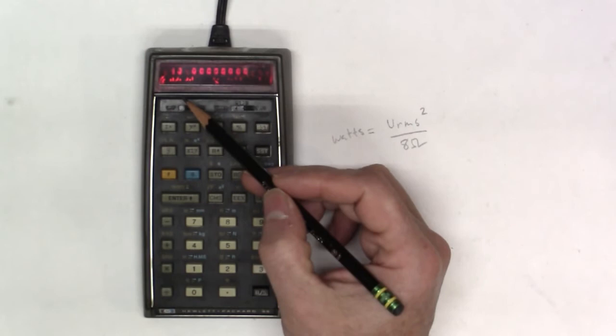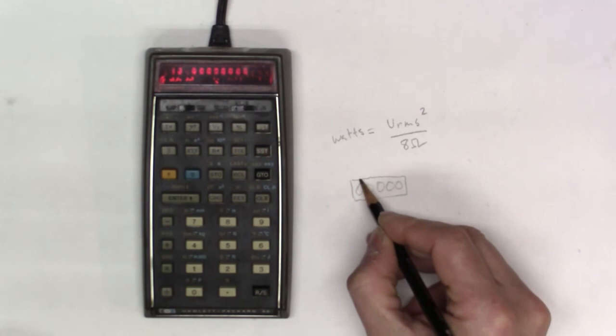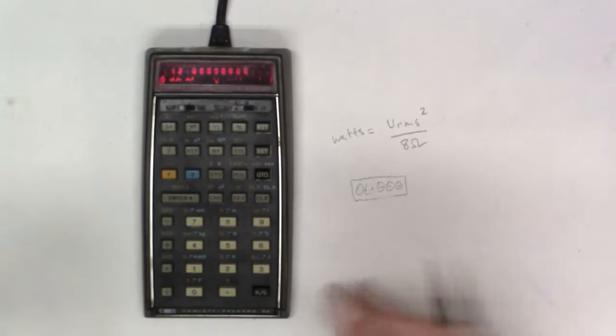So that's just how the programming's done, and it's pretty fancy, but here you can see some of the digits are not lighting up correctly, and that first LED is kind of a chip like this. And I tried resoldering some of the pins. It didn't make any difference, and I can kind of see that because like these center segments here, they seem to work, but these two don't. And one of the LEDs here and here work, but the inner ones don't. So I think this would have to be replaced if I wanted to get it to work.